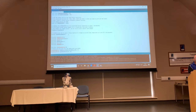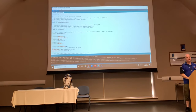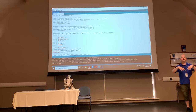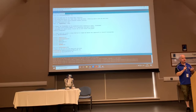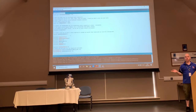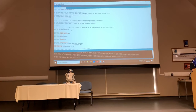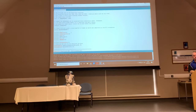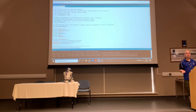We're also going to tell you that we're using something called software serial. Now, Arduino has two different ways of talking over serial, okay? And you're going to be potentially communicating with another Arduino, maybe in your dome, which is going to control panels and lights and all that sort of stuff. So there's what's known as hardware serial, which will use the TX and RX ports on your Arduino, or software serial, where you can say to use whichever port you want. In our case, software serial is actually going to be what's controlling the Syren 10 and the Sabertooth. We're not using hardware serial ports because we've got two things, so we have to use the software version of it.